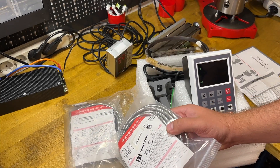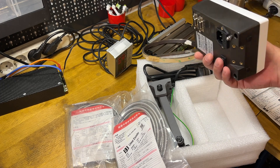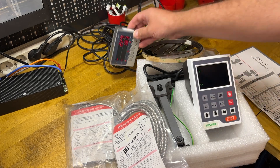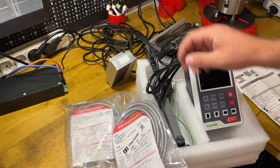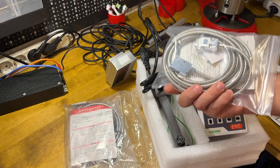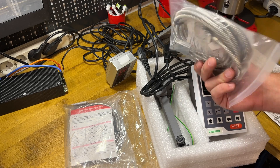I will show briefly the modifications I need to do. This device runs on 220 volts, so I will remove the 12-volt power supply for the old device and mount this cable later. First I'll install the scales, then sort out the power supply so this device turns on together with the lathe. Then I'll mount the sensors and scales back, and test the device.